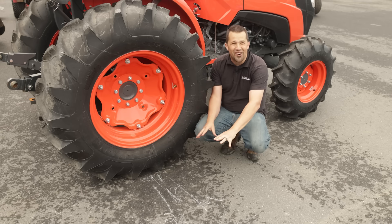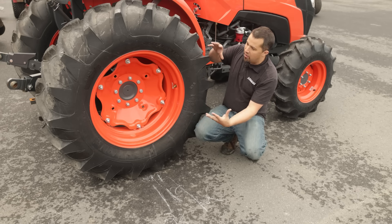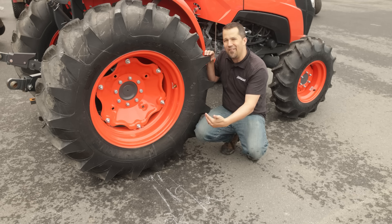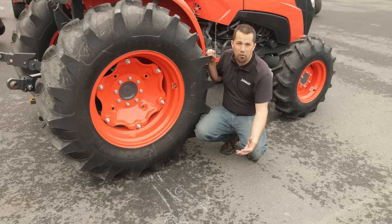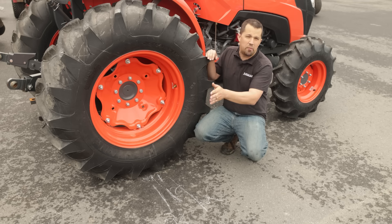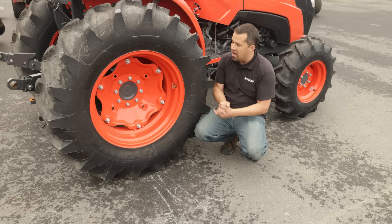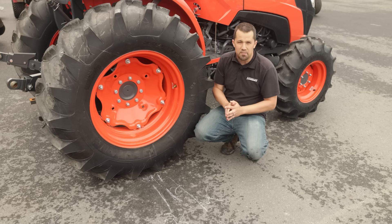Looking at our results on the ground — and recognizing this is not the world's best science — you can see that while the tire inflation probably did change the size of the tire to some point, it wasn't changing it enough to make significant impacts on the math. The difference one way or the other is maybe one percent. What's considered an acceptable lead on your tractor is really anywhere between about zero and five percent. You wouldn't want to be at the upper bounds — that's when you'll notice a lot more binding in the four-wheel drive shaft. But you shouldn't have to worry about tire inflation pressure pushing your lead out of spec.